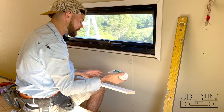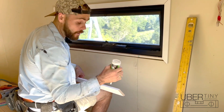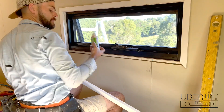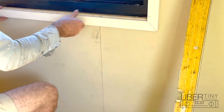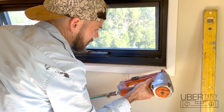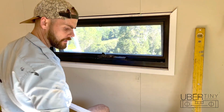I put glue on both sides of the miter — very important to help stop them spreading apart once it's painted and putting a crack on your miter. I then push the top architrave up into place, get it looking about right, and put a nail at each end. I still just put one nail on each end at this point to give myself one more opportunity to make any adjustments.